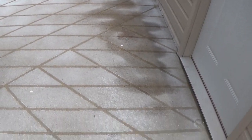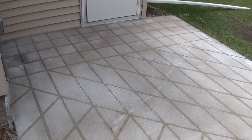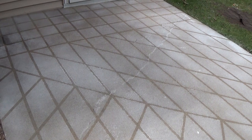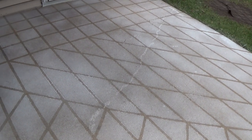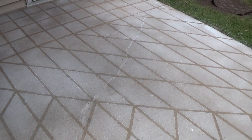We just got this little spot left to dry. I'm gonna use the same sprayer I used to put down the Glytron for the sealer as well — it is a water-based sealer. Just make sure the sprayer is cleaned out pretty well — don't worry about the crystals in it, just make sure there's no excess water left in it. Make sure it's all cleaned out decently. I'll be back in about an hour.